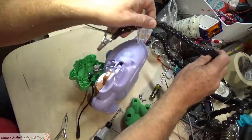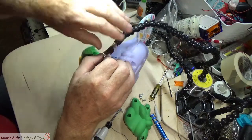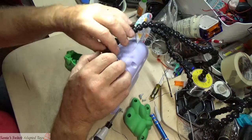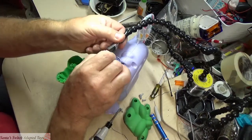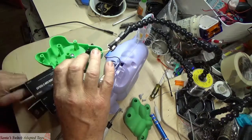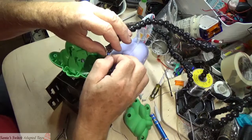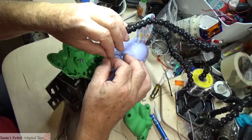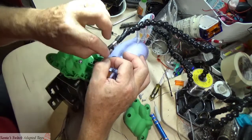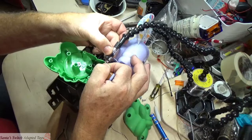I need to set this up properly. Apparently what I did when I soldered that was not very good. Let me turn this around so we can see which side we're soldering on. I'll bring over a couple of supports to support the weight of the housing. There are two connections on that switch that you need to wire to, and you want to make sure they're properly soldered.